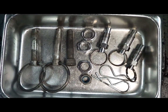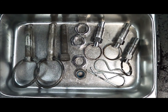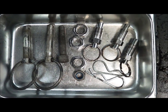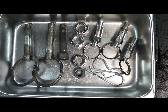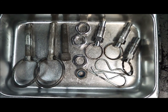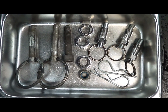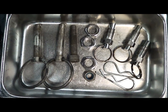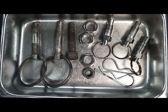We have got the free iron and the carbon washed off and rinsed off with water. These parts we did not dip back into evapo-rust or apply any rust preventative on them because some are going to be painted, and some are going to be preserved with oil since they are moving parts. But you can get about two weeks' worth of rust prevention by rinsing off the carbon and the free iron, then dipping them right back into evapo-rust and letting it dry. So these parts have had the rust removed and their usefulness restored.